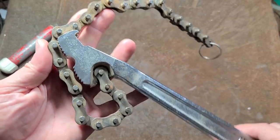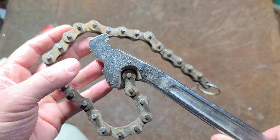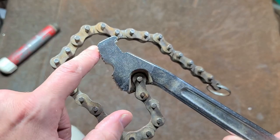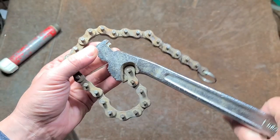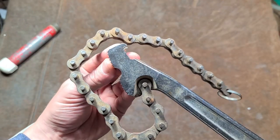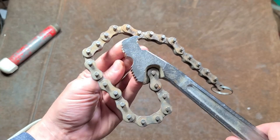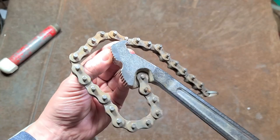There are certainly plenty of other styles. I call these the bi-directional flat jaw style chain wrench. I like the ones that have more of a curved jaw because they get more of a bite. These tend to work much better on larger diameters as opposed to smaller diameters, and of course hex fasteners, oil filters,